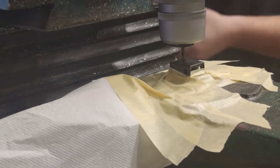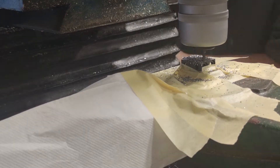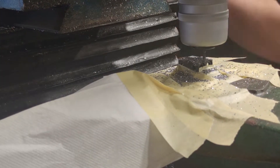I also had to modify the fixed bearing block for the ball screw. I did not want to tear apart the whole assembly, so I just clamped the bearing block in the device and milled about 2 mm from one side for clearance.